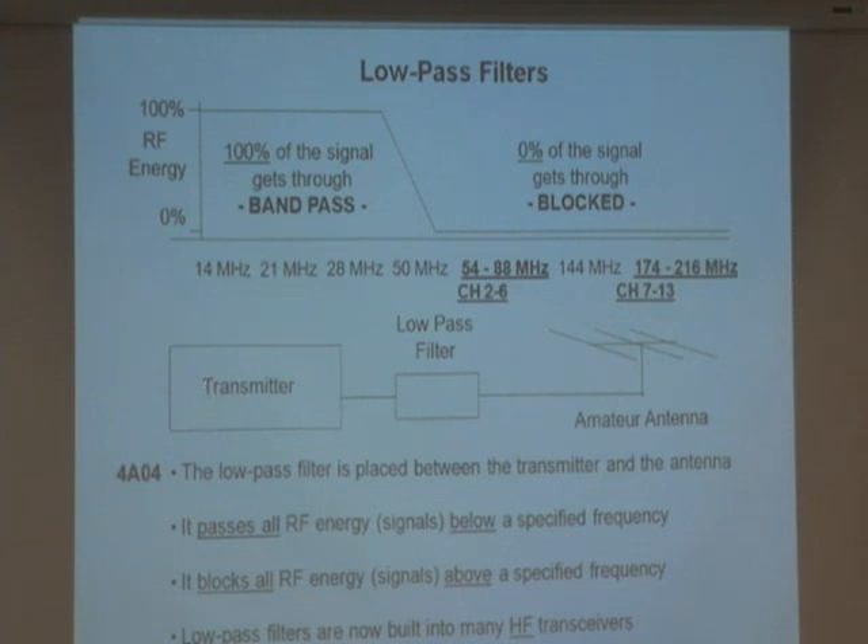I'm trying to transmit on 21 MHz. Where is 63 MHz? Up in the television channels. So if my third harmonic is coming out when it's not supposed to be, and my radio is not too far from your TV antenna, your TV is going to receive this bad signal. If you're watching channel 4 or channel 5, you're going to see and hear interference on the television.